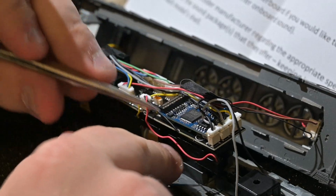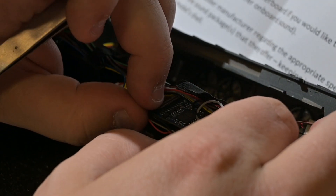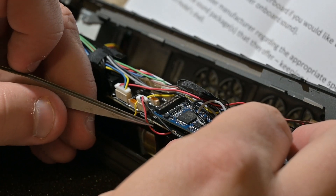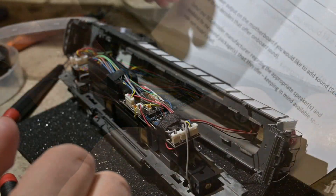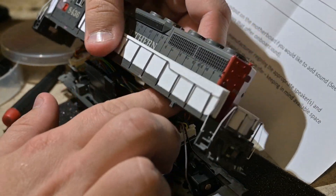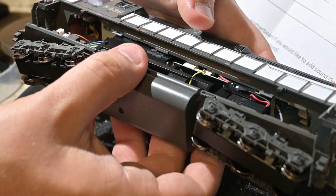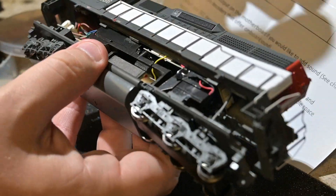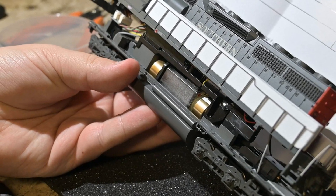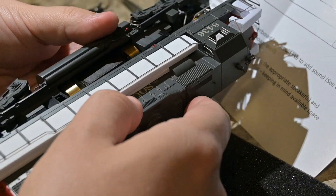After learning about the motherboard, you can see there's that little divot — this takes a lot of the slack off the black speaker wire. I'm going to do the same real quick for the red one, being very gentle on the speaker lead. This speaker wire's got enough space — you can just cram it up under here. Now comes the fun part of buttoning everything up. One thing I've found that really helps is to do this upside down when closing other locomotives, because you can watch the shell and see if any wires are getting pinched, and then use tweezers to poke stuff around accordingly.